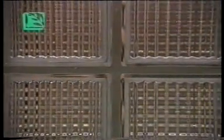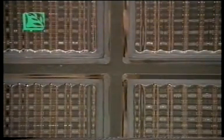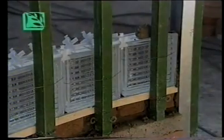Finally, we can move on to the vertical construction of an internal, slightly curving wall using Fidenza vetro arredo plastic spacers to obtain a 1 centimeter space between all the bricks. The shape of the wall has already been outlined by 2 metallic U-shaped uprights placed at both ends.